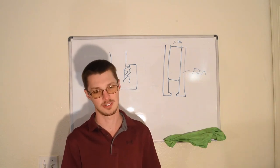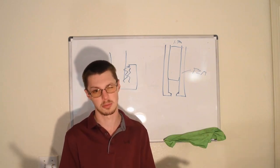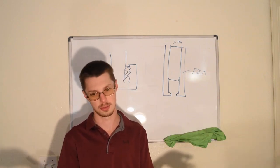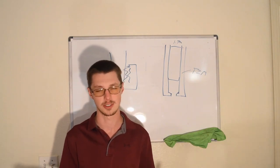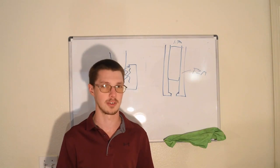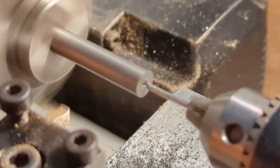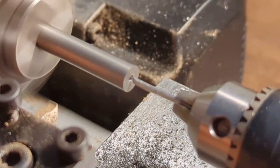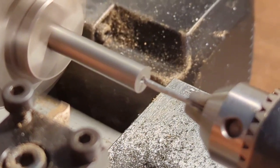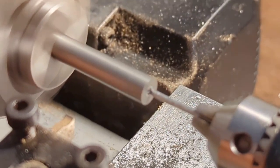We're going to run some tests to see if that's the case, and I've inserted some clips here to show some of our tests using brass versus molybdenum, with aluminum wire being inserted into a small hole rotating at about 5,000 RPM. And you can see that the galling behavior is significantly different between the two. So, okay, we're inserting 6061 aluminum into a rotating molybdenum hole 1.7 millimeters in diameter and 1 inch deep, about 25 millimeters deep.